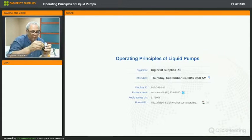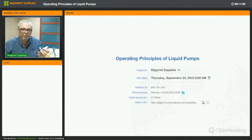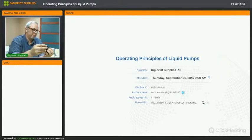And the fact that you actually can take this off doesn't mean that this is for maintenance or anything. It's just a way for KNF, for everybody that makes diaphragm pumps, to make it modular. You can have your outlet and inlet connection on this side, but you can also have it on this side. You just turn this. You can have a different seal, etc., etc. So let's open it up.